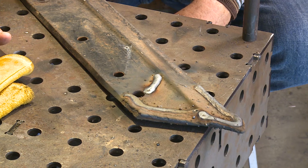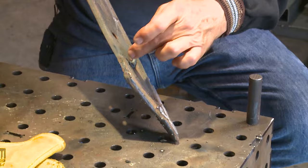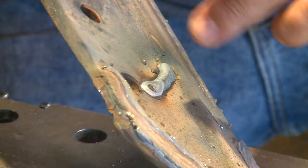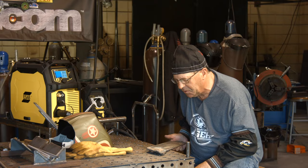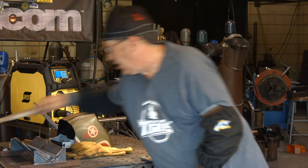I started back here on this back shoulder and welded around through the toe of the weld. There was another crack that started right on this bolt hole — it was actually into it. I wanted to weld over the top of that and see what was going to happen. It did not crack back out next to the toe of the weld. Do I have some spatter? Yeah.